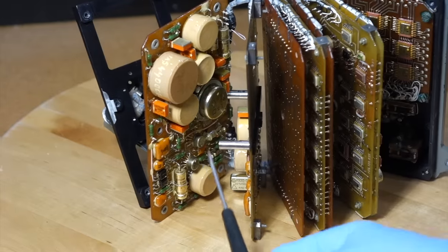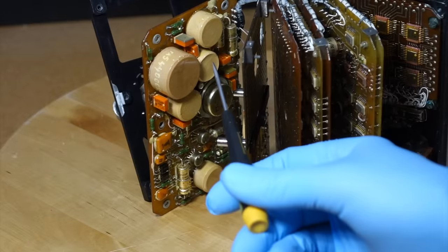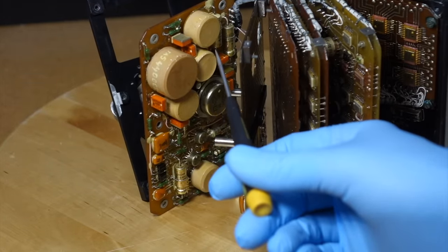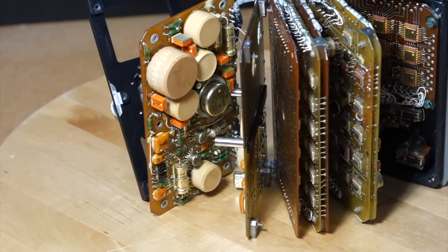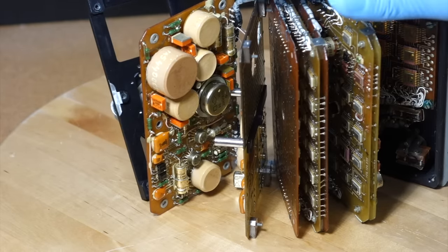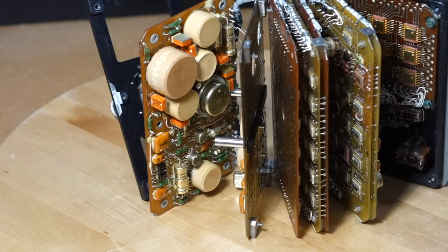And then that drives a transistor here, which then sends pulses through an isolation transformer, because they didn't have opto-isolators then, which then provides the drive signal for the big transistor. Now, you might wonder why they do all this instead of just using a simple buck converter. And the reason is that this gives you isolation between the power coming in and the circuitry. So there's no actual electrical connection. This is what you do in your cell phone charger, because you want to be protected from the AC voltage. Usually with 24 volts coming in, you don't need any isolation.